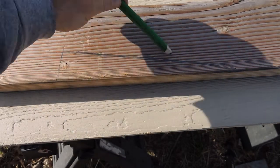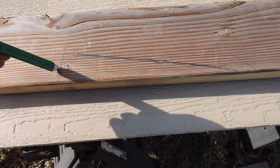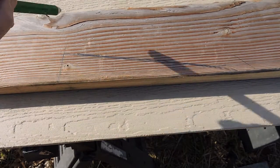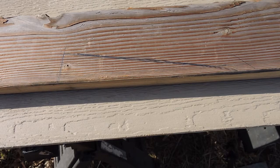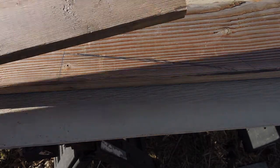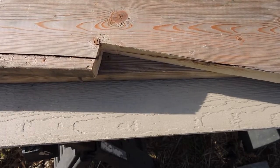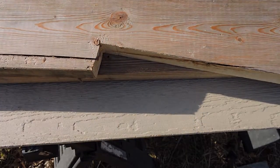After you scribe it, you're left with a triangle mark like this. At that point, you just take your skill saw and cut these two lines, getting as close to the corner as possible, then use a jigsaw or Sawzall to cut that out. You end up with a board that looks like this. Once you get the first one cut, you can use it as a guide to trace the others. That's the easy and quick way to mark and cut your rafters.